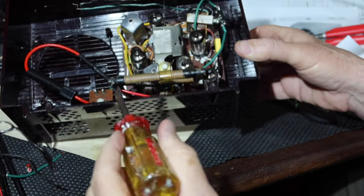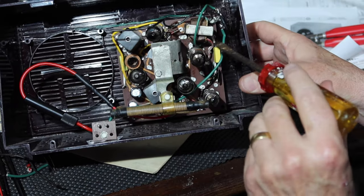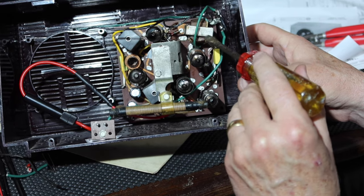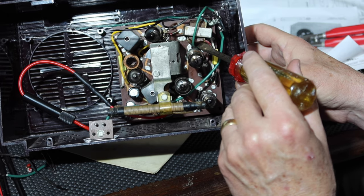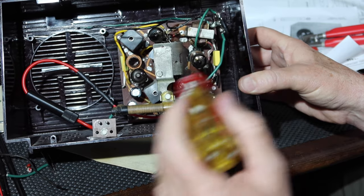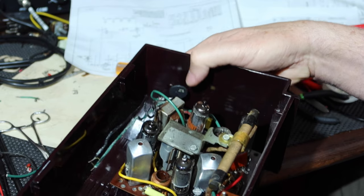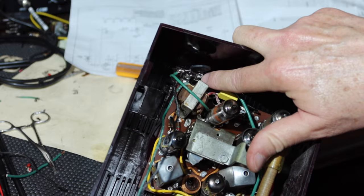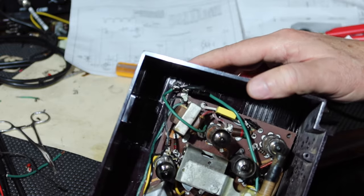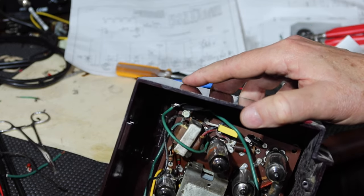Okay. Now the other one, which is the other lead, which is originally green, came over here and went straight to the board over here. So what I did was I unsoldered this, re-terminated the connection to the board so it had not been flexed back and forth a number of times. And then here is that CL90 thermistor that you can see in there. So there's a CL90, and it's attached to a little barrier strip down there, or you want to call it, and that it's held in by the screw that holds the circuit board into the case.